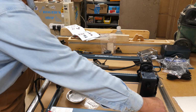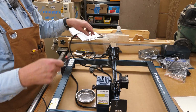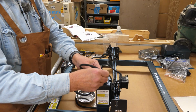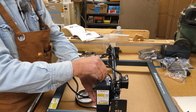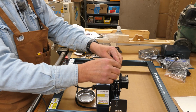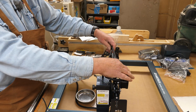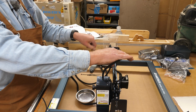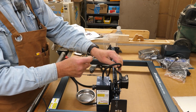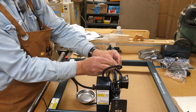Bring this around to the front again. Next is the line for the air assist, neoprene hose here. This will plug in here, slips over that little nipple that sticks out the top. And now you will want to make sure you've got some slack there. I'm going to tie this along with my cable, but don't pull those tight or you're going to pinch off your airline. You just want them to be kind of like a guide.